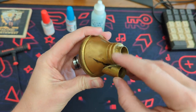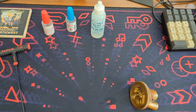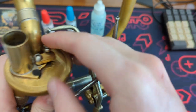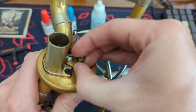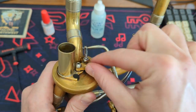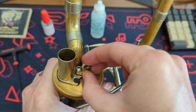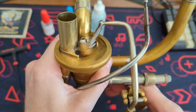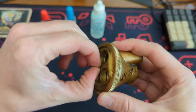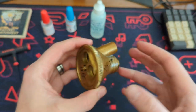A really bad valve will feel similar. What you can do is take off or just feel the stop arm and wiggle it by itself — isolate it from everything else, wiggle it up and down, move it side to side, in the direction it's not supposed to move. It's supposed to move this way; it's not supposed to move in any other direction. It should not move in any direction except the correct rotation. This one without bearings can move in all sorts of directions, and that will make noise because it's wasting energy, and the valve will not seal.